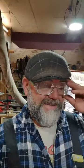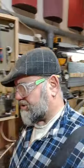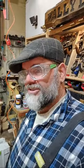There we go. How's your laser going? I've actually fixed it and it's working now. What was happening is it was getting halfway through the burn and then it literally just froze. No matter what I did, you couldn't restart it. So I've actually earthed all the frame sections to each other, and then it goes to a connector that goes into a plug into the wall. So it disperses static electricity.